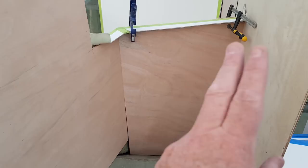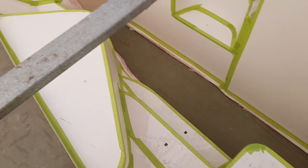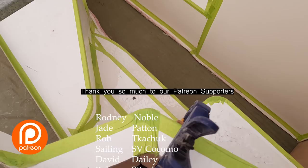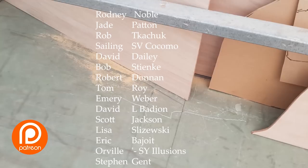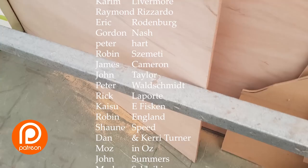I've actually left a small area right here — there was no point cutting it to that piece because ultimately that's going to be glass at the module and it's just a little bit of extra strength. Once I get these in place I can fill and tab this bulkhead, this bulkhead, this bulkhead, all in place, and then ultimately I can lift these modules vertically straight out to reinforce them where needed and then sit them back in place and glue them in. The bulkhead is designed to go on that line here but this purlin is in the way, so tomorrow I'll move that back about a foot to give me room to put this in place.